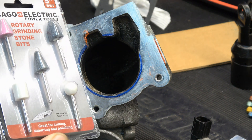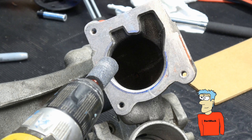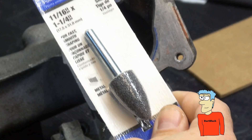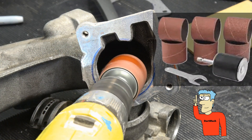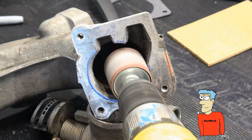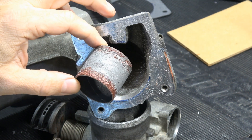You can buy bit sets like this at Harbor Freight, and this is exactly what you do not want to buy. These little grinding bits kept on getting packed up with aluminum. I tried different sizes — got this cylinder, a cone — and they all did the exact same thing: took little material away and just got packed up with aluminum. So I ended up getting these sanding drums. You can find these things all over the place and they did a much better job. They took off loads of material — they do get packed up with aluminum from time to time, so just make sure you have a couple extras. This is probably going to end up happening to you quite a bit, so have a lot of these ready.